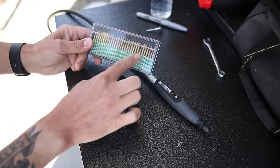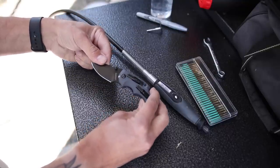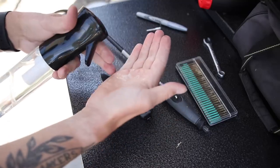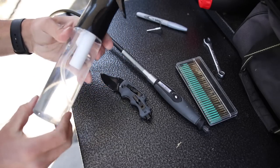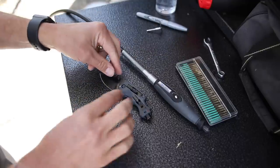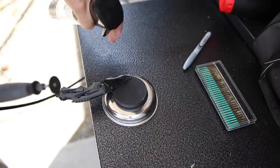The biggest thing you have to worry about when cutting serrations into your blade is that these blades are already heat treated and tempered for good edge retention. We don't want to ruin that heat treat or temper, so we're going to be very careful not to overheat the blade. What I have here is a spritzer bottle — just a cheap $1 spray bottle filled with ice water will be fine. We're going to spray the blade with water from time to time to keep it from overheating. We don't want the blade to get above 300 to 400 degrees — that's when it starts messing with the temper. Basically, we just want to keep the blade cool enough that we can touch it with our fingers.